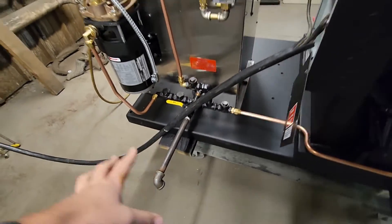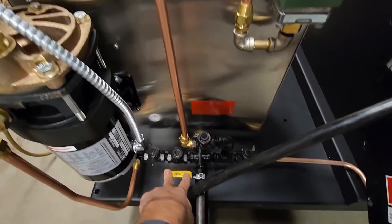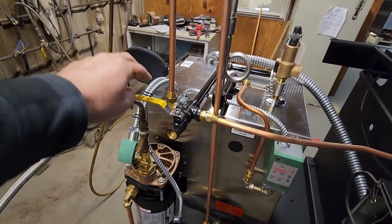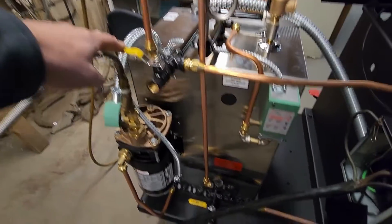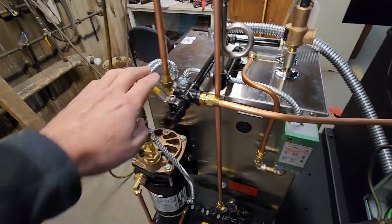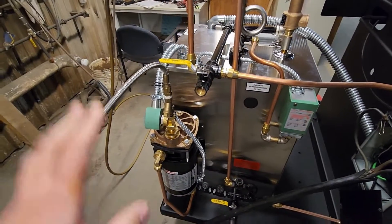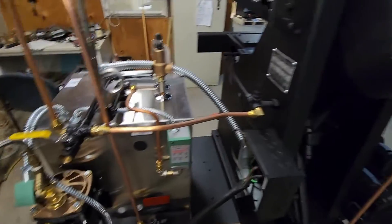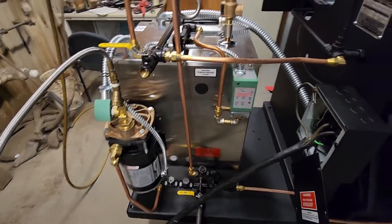Down at the very bottom we have a drain line. If you open this ball valve here, it'll drain all the water out of the boiler — we recommend only doing that when the boiler is off and under no pressure, and the water should be cool at that point. Moving up top, there's another ball valve that's used as a vent. If you're draining down below, you can open this one to let it drain faster, or use it for an accessory. One of the most common problems we see is people hooking the water line up to the wrong fitting — that will flood the entire press with water. Make sure you hook it up to the pump fitting.